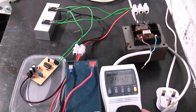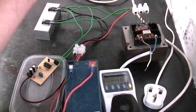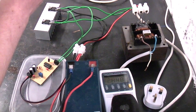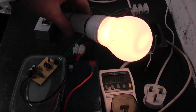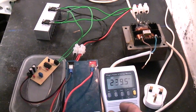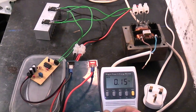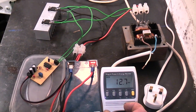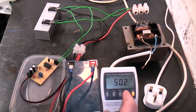The voltage has dropped slightly to 244. This plug is connected to a lead with a normal light socket on the end, fitted with a compact fluorescent lamp rated at 20 watts, 145 milliamps, 220 to 240 volts, 50-60 Hz. It's pulled the voltage down to 239 now drawing the 20 watt load. The current reads 150 milliamps, and the wattage is 12.7 watts — the bulb hasn't fully warmed up yet as CFLs take a few minutes.